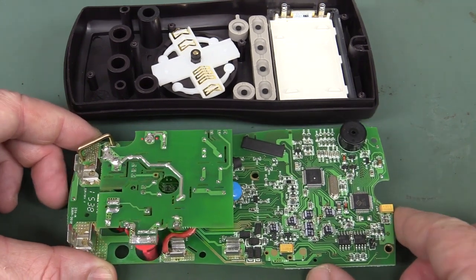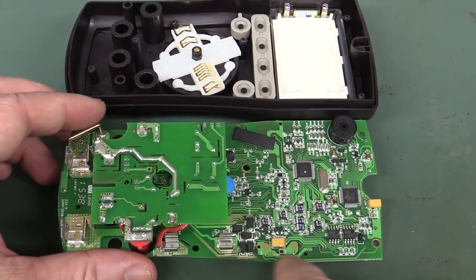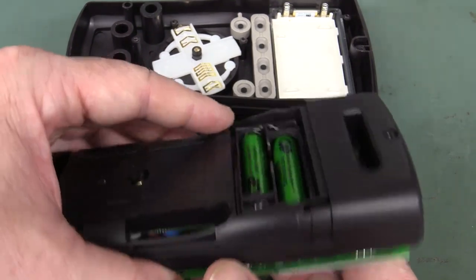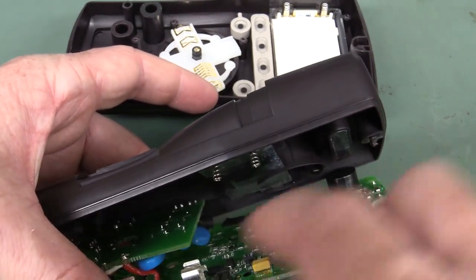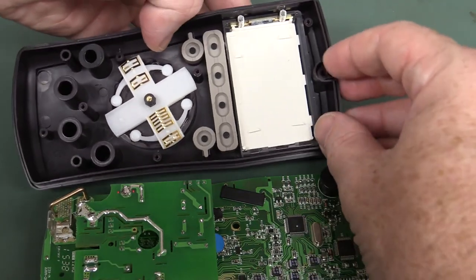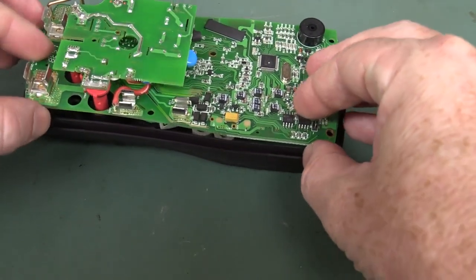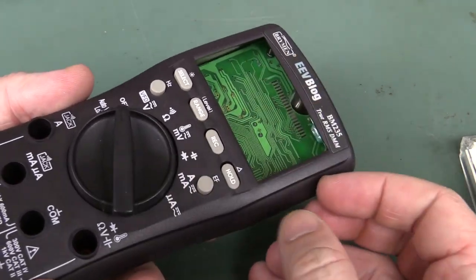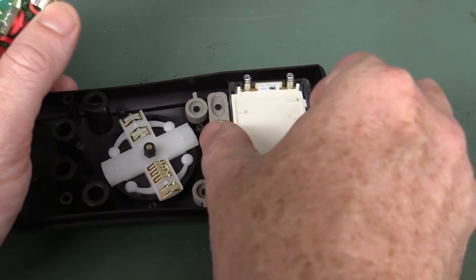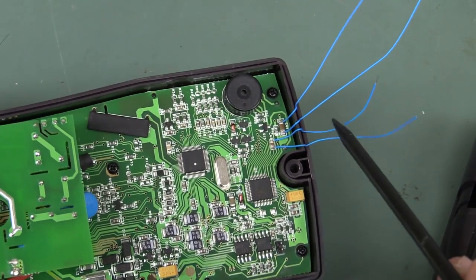What I want to do is get in here and probe this thing and see what happens. The battery compartment has these two springs and they contact pads down here, so it's really annoying — I'd have to solder some contacts. I could solder some wires on, bring them back out, screw the board back in. Another way to do it — which is what some of the guys on the forum have done — is to physically remove the screen like that, whack the board back in, and then access and probe stuff through the front. But that disconnects the LED. So I'll put the screen back in and solder some wires. I've soldered four little wires: ground and the main output, the 10 microfarad filter cap which is the culprit, and the charge pump capacitor.